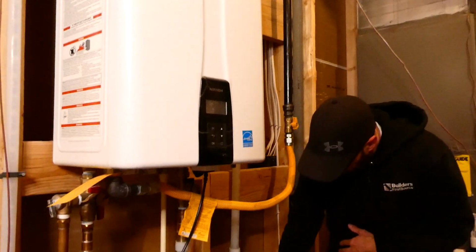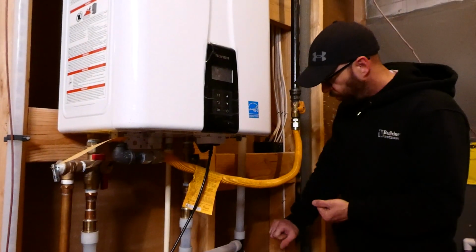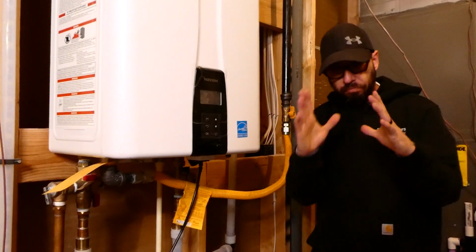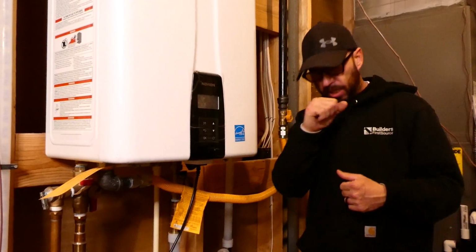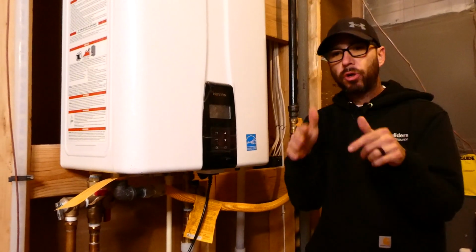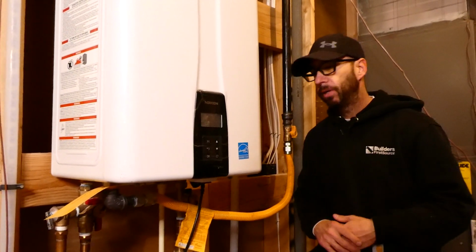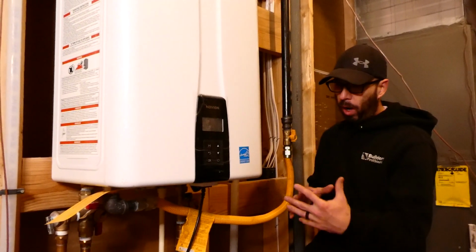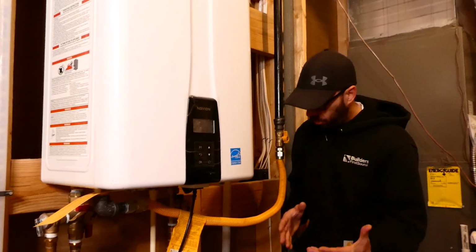Generally speaking, right around this area is where the water service feeds the house, and then we'll go and feed your yard. Your yard will have its own kill lever as well. And there's an irrigation head we'll take a look at on the outside of the home, which is also what you would want to kill to stop feeding any floods in your yard. That's also what you want to turn off when fall comes, when it starts to be below freezing at night, to prevent your water lines in your yard from freezing. So that is, generally speaking, how the water feeds the house and the yard. Now let's look at the generalization of your plumbing system.